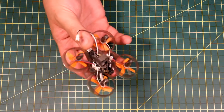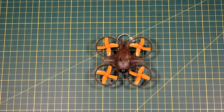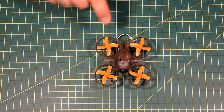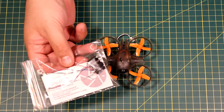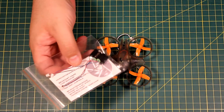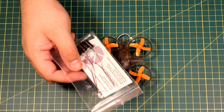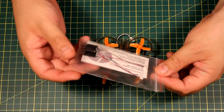So I figured I'd give it a shot at trying to fix this. Looking at this quad, these are standard brushed motors. I did a bit of research — as in I looked at the product sheet. I found that 615 motors, so that's 6 millimetres round and 15 millimetres long, would fit these. So I've bought a pack of four from Micromotor Warehouse and we're going to see if these help. These motors are tiny — I guess they are because they're only 6mm diameter.